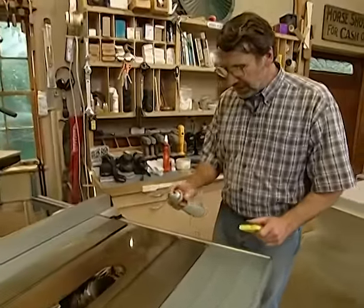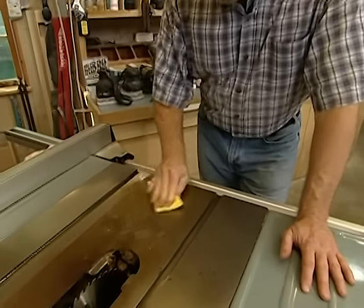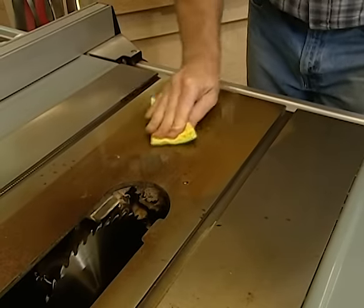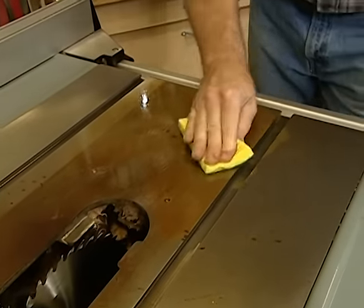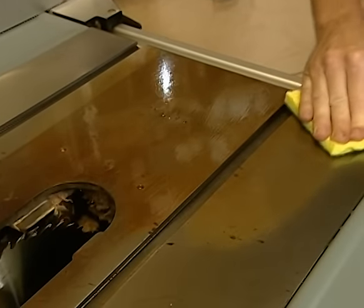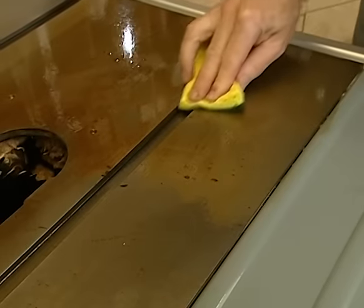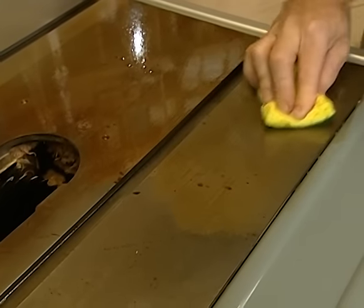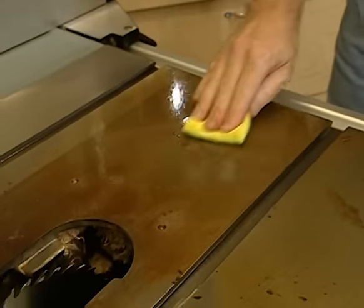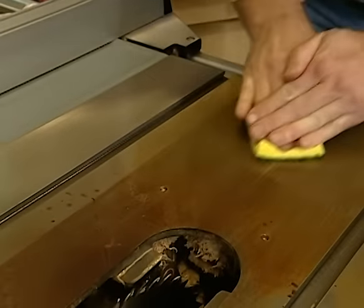The best thing you can do for your table saw is keep the top clean — I want it as slick as possible so the wood slides over it without hanging up. As with any horizontal surface, there's always a temptation to put drinks or coffee or lunch on top, and around this workshop if that happens, they are severely reprimanded and don't do it again. Every once in a while there's a need for some serious maintenance. Here I've sprayed on a lightweight penetrating oil and I'm using one of these nylon pads — everybody has these under the kitchen sink for cleaning pans — and just work it in until all that rust is loosened up.